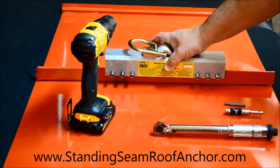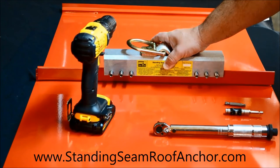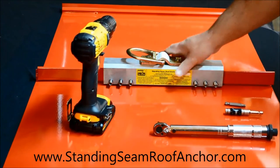When the clamp is up off of the panel, you have to be careful that you don't get it tilted to one side during installation. You have to hold it nice and straight. So on inch and a half or shorter, it's very simple because it does sit pretty much flat down on the panel.